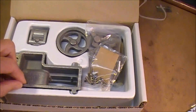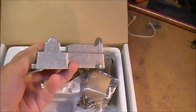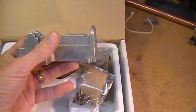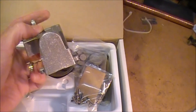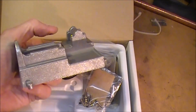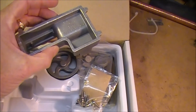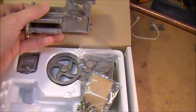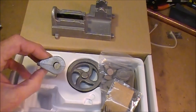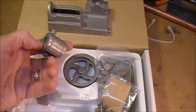In the box are the castings themselves. What we mean by castings are, this is the way that they come out of the foundry. For example, there's no holes here for the crankshaft. The base has only got a foundry finish on it — nothing is machined flat. Even though these are excellent castings, some of the best you will normally find from a foundry, they do a really good job of that. This is the cylinder, and of course it's got a core in it, but it has not been bored out. There's nothing in here for the valving or anything.